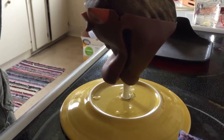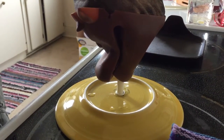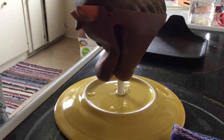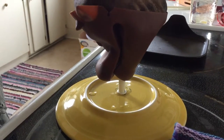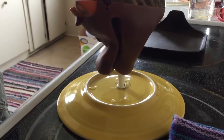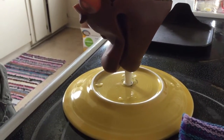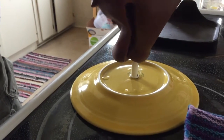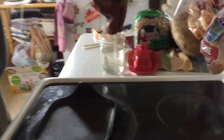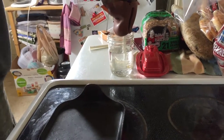You soften the pipe with heat on a skillet, then move it to a cold plate. He found that for suction to get it to widen back out, he liked to have a little bit of water on the plate. You could use a tile, granite, or something hard and cold to cool it off, because you have to hold it in its shape until it's cold. Then he puts it in the water just to finish cooling it down so he can do the other end.